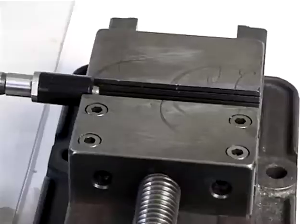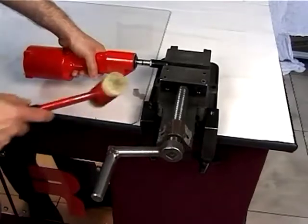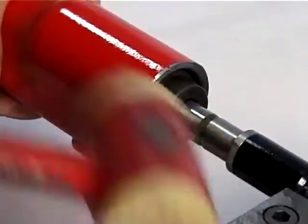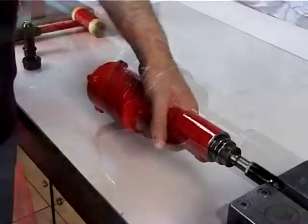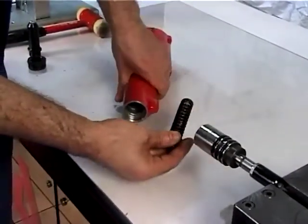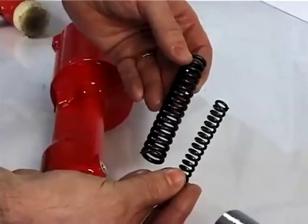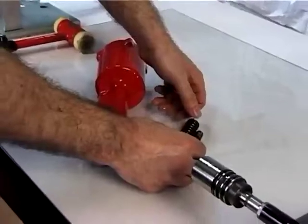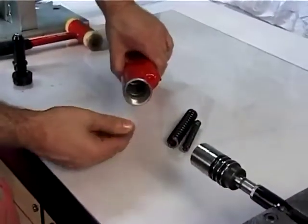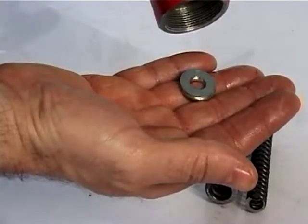Fasten the clamps holding cone, figure 17, in an adequate vise. Then by means of a rubber-coated hammer, take out the unit contained inside the tool body, figure 5. Take the two springs out, figures 29 and 55, as well as the washers, figure 49. Attention, the tool body may contain 1 or 2 washers, figure 49, depending on the production lot. Always remount the same number of washers.